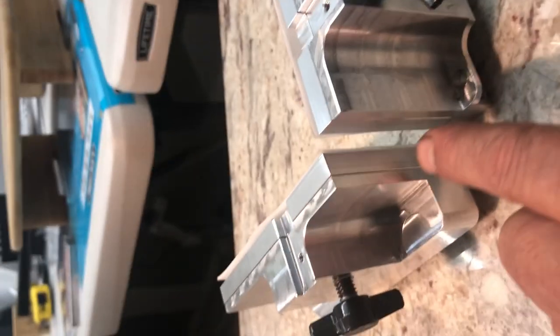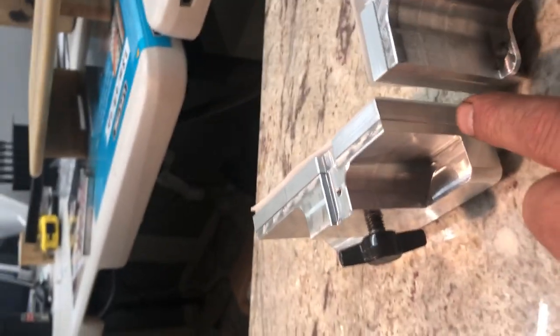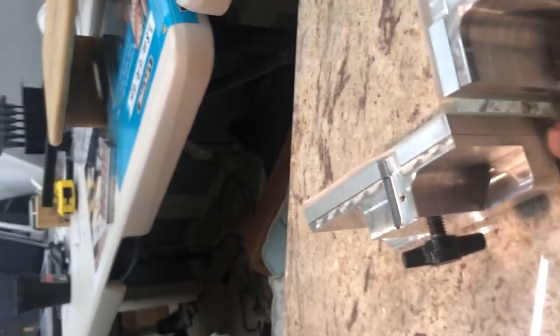It's very self-adhesive and ATG friendly. When you put it back, please remember to leave a hairline gap here on the inside — about 1/16" — as well as here on both sides. That is to allow you to see the gap here. We like that gap because it gives us access to adjust and see the corner of the frame, and not just to see but to adjust by pushing and pulling.